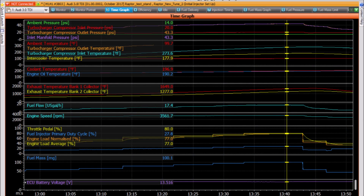Notice how smooth that engine is. The GoPro was just mounted on a flexi mount, and while it's running at high RPMs or even mid-range, it's super smooth — it wasn't moving around at all. There's actually more vibration at idle. So here's the run: as expected, the boost numbers are lower and temperatures are lower, all because of the new intercooler. Looking at the boost — 43.3, so that's a net boost of 29.3 pounds. Last time we had 32 pounds of boost, and admittedly I've put the prop to a more coarse pitch setting, putting more load on the engine, so we didn't get as high an RPM this time.